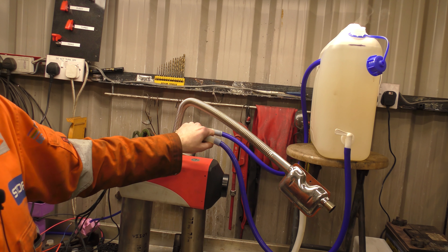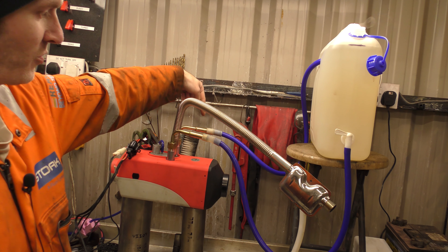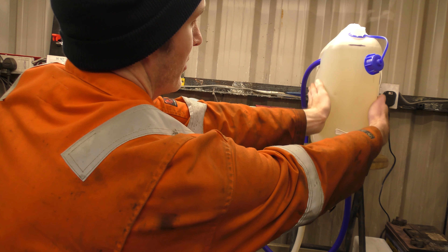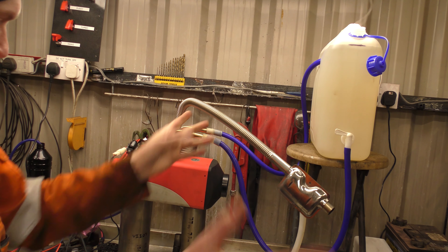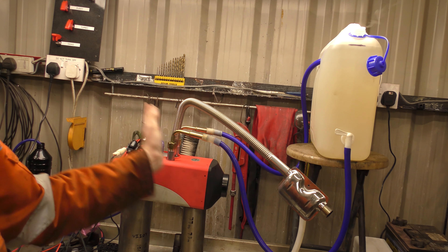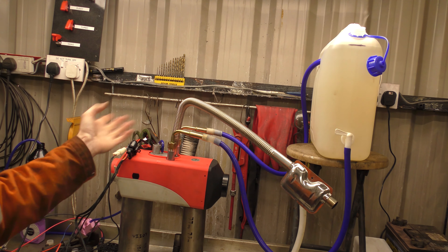This pipe, which is the cold pipe from the bottom of the tank, is still cold because the water is flowing through it. This one on the other side is hot and is exiting hot water up at the top. And it is warming. Just know that it does work, should you want it to, and if you want to improve this setup, please be my guest. But upside down, it will run and it will thermosyphon.